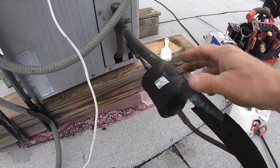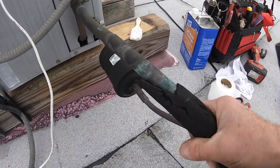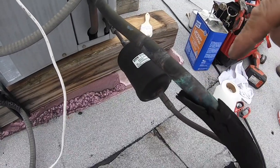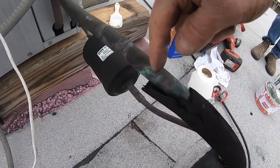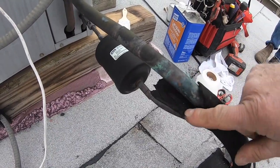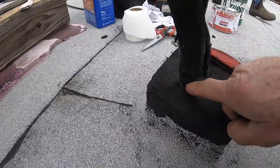That is — this normally freezes up during the summer. But this is an insulator and the insulator has corroded away and there's no more insulation. What happens is the water — the rain falls and this collects the water right here and it follows this foam down into the building.